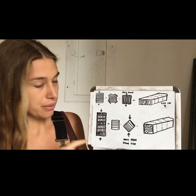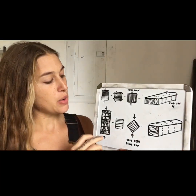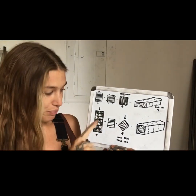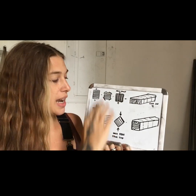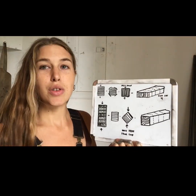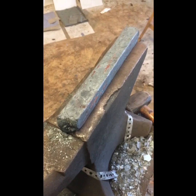Once you have that stacked, you're just going to press this down. Once you have it pressed down into a square bar, you're going to flip it 90 degrees and then only press it from the top while maintaining the side. Press from the top, flip on the side, crush it in, go from the top — until you have another square bar. Once you have your square bar, cut it into four equal pieces. Remember, you have to grind everything truly flat and grind all the lines.